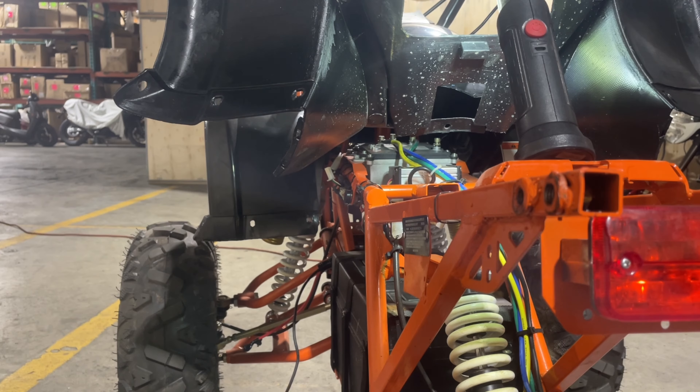I'm going to show you how to check continuity — to tell if power is going through this fuse. You will need some sort of multimeter to check for continuity. You'll see right there it says 40-amp. It's a 40-amp fuse, and it's about an inch and a half to two inches long. This one has got some rubber sealant on it because we seal our controllers and it got some on it. So now I'm going to go get my multimeter and we'll come back and test it.